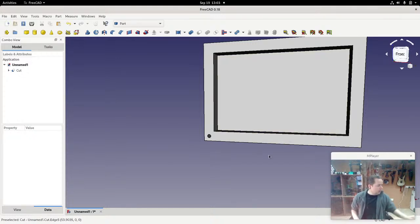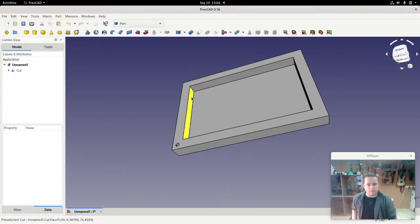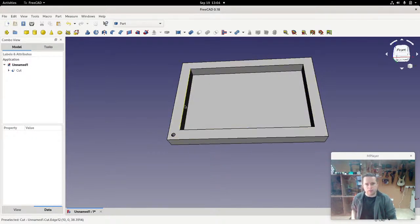But it's not really the electronics. Now in a lithophane what you really want is you're creating a light panel, and the problem with LEDs is that they're not panels, they're points. So the light points. If you have your picture too close to the LEDs, then the points come through as just bright spots, and that's not what you want. So what I'm planning with mine is that there's a bit of space, as you can see in our little design here, and the LEDs will be above that space, and then the back space will be covered in tin foil, which will act as a reflective layer for the light. So the LEDs will actually be pointing inwards, shining the light inwards, and then the light will be bouncing off these and giving us a lot more of an even light across the picture itself.